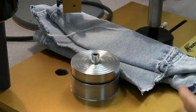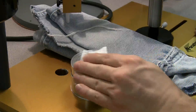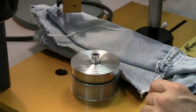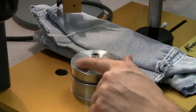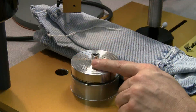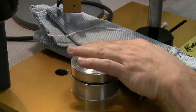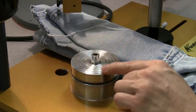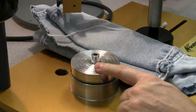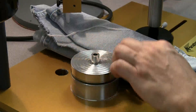The first step in that process is to make sure that the platen is extremely clean — you don't want any dirt, grit, grease, or anything on there interfering with your measuring. Use a little spray alcohol and a tissue, run the machine at slow speed, and just wipe the platen very carefully. Once you're sure it's clean, make sure there are no dense dings or scratches or imperfections in the surface of the platen. Because your fingers can detect smaller imperfections than your eyes might pick up, the easy way to do this is to run the machine on very slow speed or just drag your fingers around the platen. This is a process that should be done every time before you mount a lap, because you don't want any small piece or little chip of quartz to be mashed into the platen. Wipe the platen with your fingers — make sure it's clean, no chips, no dents, no dings.